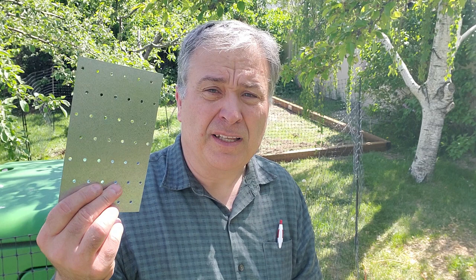The big thing here is you just need to make sure you use decking screws or some kind of screw that isn't going to rust — something that's going to last forever. Then here you can see me with a spike, about a 7-inch spike or nail. I used several of these in each of the corners to nail the 4x6s together. Surprisingly, they didn't try to bend at all; they were easy to nail in with just a regular hammer and it worked really well.